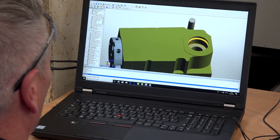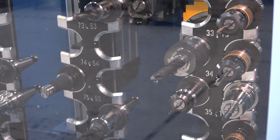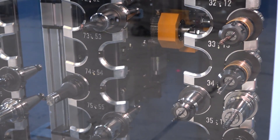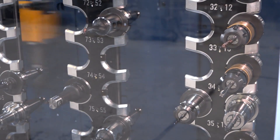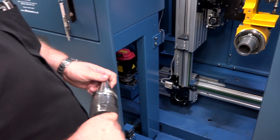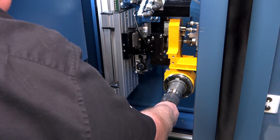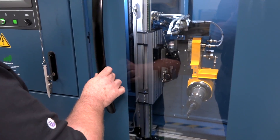That's the idea — we've proved the program out. There's no reason why we can't just throw a piece of bar on and let it run through at night. Tooling's a big factor as well. This machine has 120 tool capacity, and we've got 98 tools currently with some sister tooling. The advantage is it covers all our tooling range that we know of today, covering all the parts we're looking to put through, and possibly future parts too — we've got pockets available.